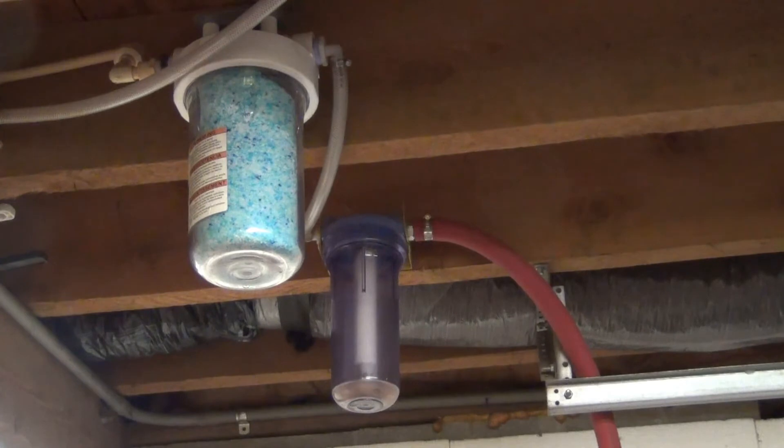One of the things I was concerned about when I first started converting these filter housings was the strength — specifically the bursting pressure. Were these things going to explode? These housings typically have a maximum operating pressure of 125 PSI, so I was careful to keep the air pressure lower than that, and I don't use that much pressure when blasting anyway.